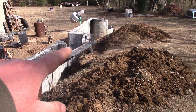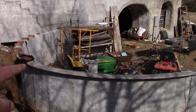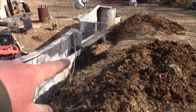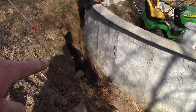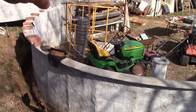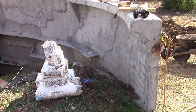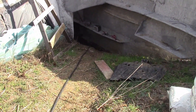The scope of my work: I've built this retaining wall, a lower retaining wall, then an upper retaining wall. I have a drain pipe that comes in at the bottom over here. I've dug it out and run my French drain right over here to my high point, and now I'm extending it this way where it will drain at a lower point over there. So we have the high point right here and it drains both directions around the wall. This is the back of the upper retaining wall.